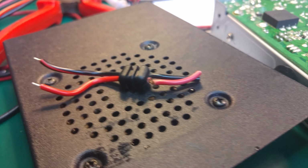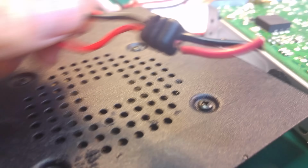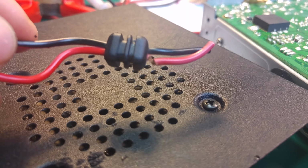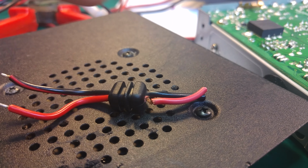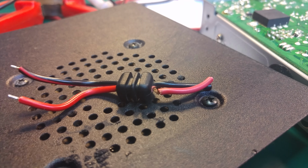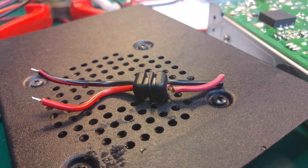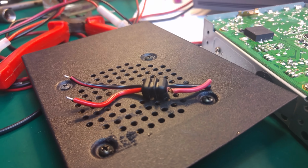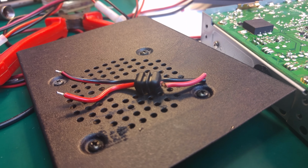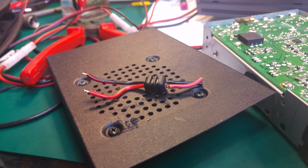and as you can see the conclusion would be, always when you've got a damaged cable, even if it looks okay, because for me that was not looking terribly bad, and maybe someone will just put tape on it and think, oh, that's okay, that solved the problem. You can have a problem inside the other part, and it will fail in an unexpected way under high current. So that's the conclusion. Always replace wiring when there is any chance of having damage inside. So thank you for watching and bye bye.